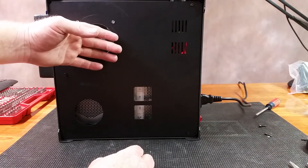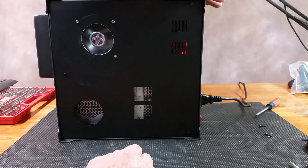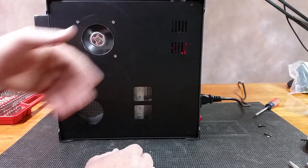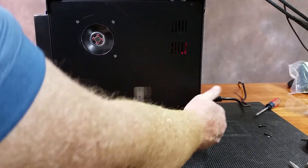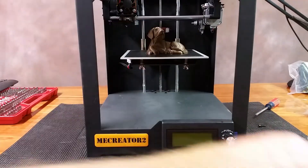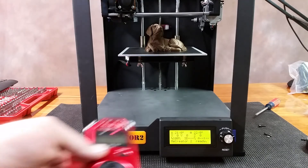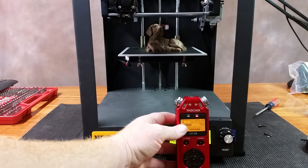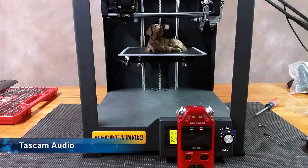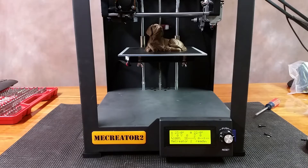As you can see, that will work. I'm feeling air coming out the hole there. I'm feeling air coming out — all the little holes — I'm feeling air coming out, so I know it's getting enough airflow through it, so it should be good. So let me go ahead and flip it back over, get everything hooked up, and let's start another print. Sounds a lot different. Let me bring my meter over here close by, set it right back where it was at the very beginning. You can still hear it, but it's nothing like it was. If I wanted to, I could actually flip that switch down a little bit and make it a lot quieter. But I'm happy with that — I think it's going to be getting a lot better cooling too.